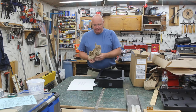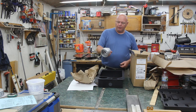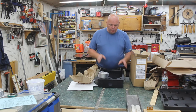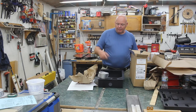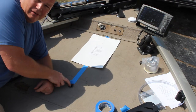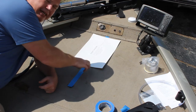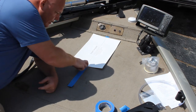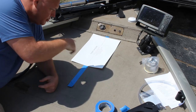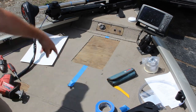Let's see what our cup holder looks like — that's the last piece. It looks like it's a nice silver with a drain. You just drop that in there when you're ready, and you'll have your tool holders and everything. I think we're going to be pretty happy with it. What I did is I used my center hole for my seat and the center of the boat to mark the center where the tray is going to go. Then I measured my template for the center, and I've got that stuck down with blue tape just to hold it. Now all I have to do is cut out the carpet around the template, and that should show me where I need to cut the wood out.